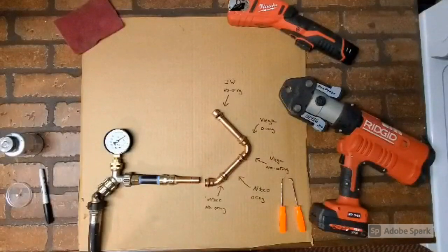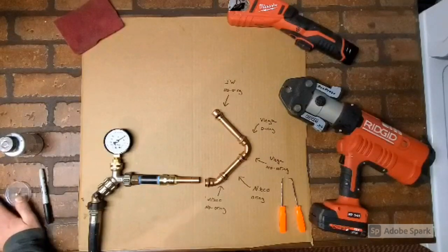There's been quite a few conversations about whether or not pro press fittings are still water tight without the o-ring, or if they are relying on the o-ring to seal. Today we've got a setup with three different types or brands of pro press fittings: JW at the top, Viega, and Nibco on the side. What I'm going to do is pull one o-ring out of each brand, press it all together, hook it up to the garden hose, and see how it does.